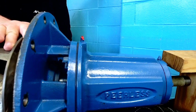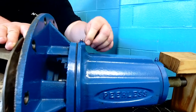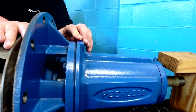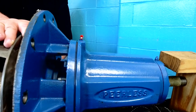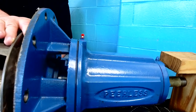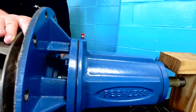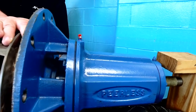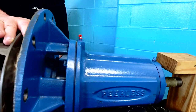This particular pump uses grease lubrication on the front bearing and the back bearing. There are zerk fittings with plastic protective caps — it's a grease fitting where you apply grease per the recommended lubrication specs in the IOM manual. You've got to make sure you've got compatible grease and don't use different base greases that are not compatible with each other. There's one fitting on the front and one on the back.